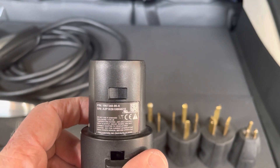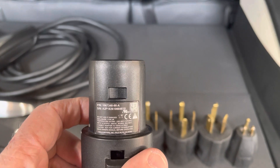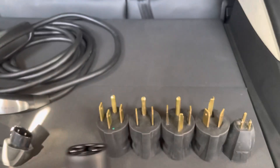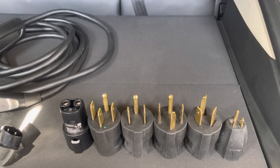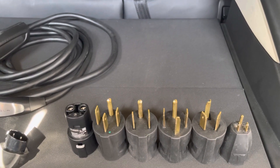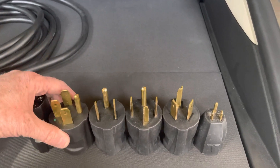To figure out your kilowatts, you take your voltage times your amperage and that will get you there. So if you're charging at 10 amps and your voltage is 250 volts, that'll be 10 times 250, which gets you to 2.5 kilowatts.